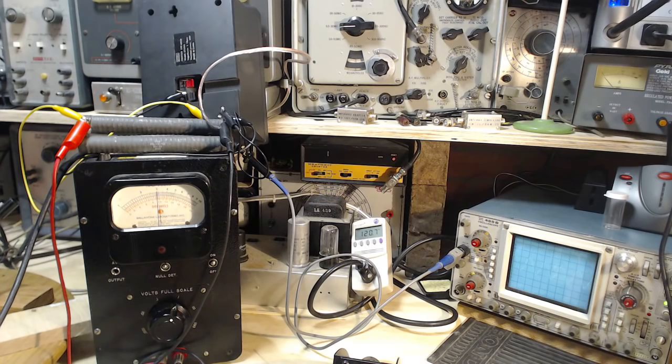Nice signal there. Now, for those of you who are really into FM, we're looking at the detected signal coming out of the FM discriminator on the scope there. And I've got the simulator running around 50 kilohertz of swing in the input signal. So the input signal is 100 megahertz. It's swinging back and forth 50 kilohertz right now.